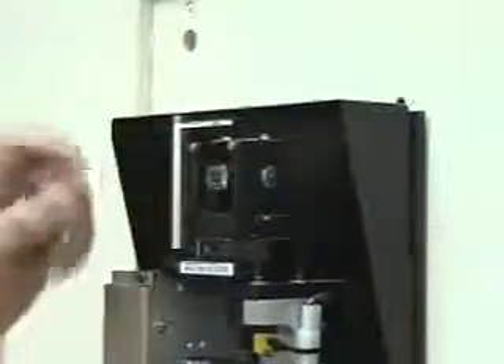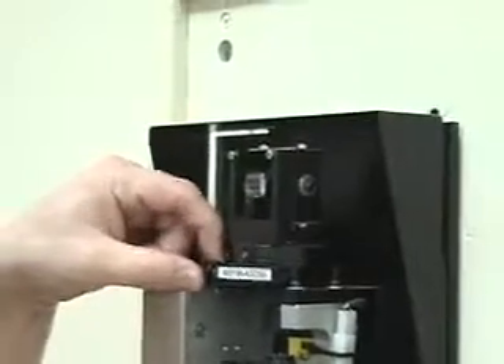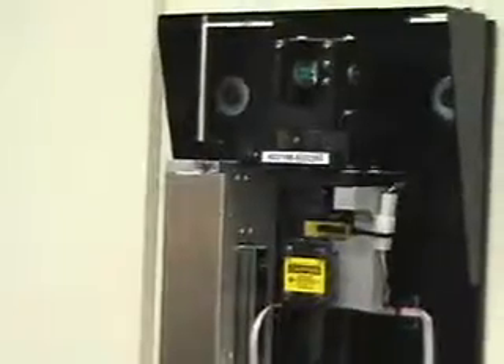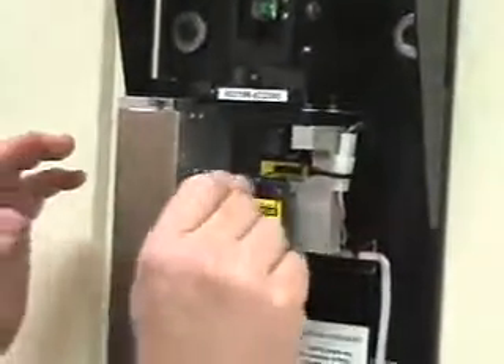To recap: first, focus the laser. Then check the rotation — make sure the line is good. Then check the angle. The rotation of the line is done by rotating the lens using the set screw — get it straight or parallel, then tighten it. Then move the whole line left or right or in or out using the thumb wheel. If there's an angle at the Phantom and the line doesn't go all the way across to hit the white line, the two screws on the whole lens assembly need to be loosened and the assembly moved in one direction or the other, depending on the direction of the error.